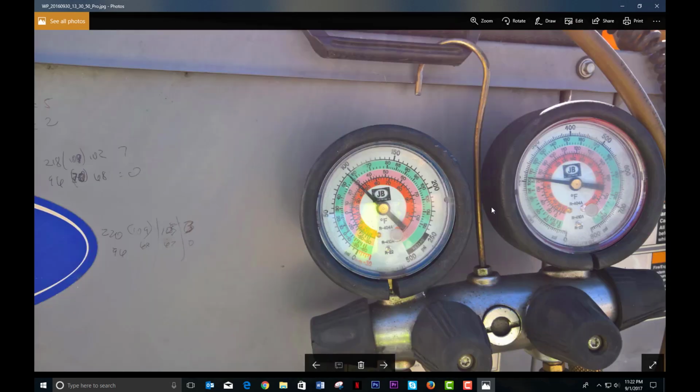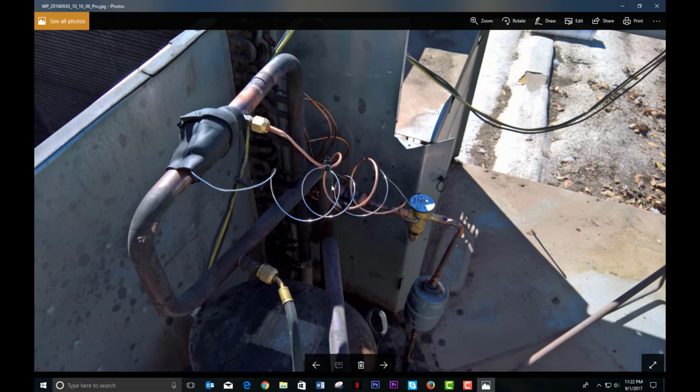I get worried when I use those capillary tubes here instead of larger diameter, but it's a lot easier to make it fit and bend it if you use capillary tube. And this is just buying one of those boxed capillary tube sets, like for a reach-in or something. I just get the largest diameter they sell and then just keep it as short as possible. It's okay that it's restricting a little bit. You got to keep them all even length because the TXV is going to open and adjust. And I definitely make sure I go a little bit up on the capacity, or just a pinch larger, on the TXV when I do that.